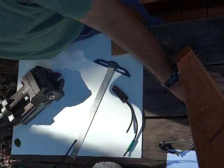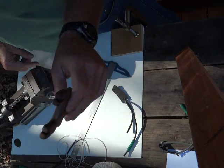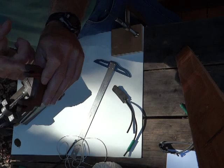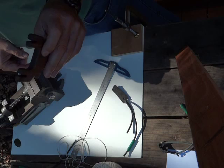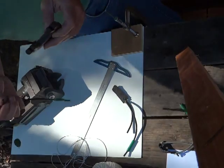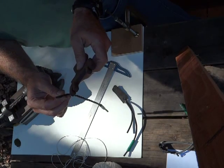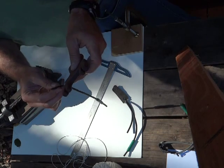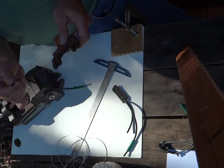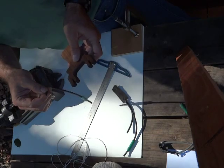One is about the fork width. Experimentally, I think I found that a good choice for the fork slot opening is about 57% of the total rubber thickness. What does that mean? Okay, for 1745, the outer diameter is 4.5 millimeters, the inside diameter is 1.7 millimeters, and the difference would be 2.8 millimeters. That ends up meaning that the rubber width on this is the difference of the outside and inside diameters, which would be 2.8 millimeters, or about a tenth of an inch.